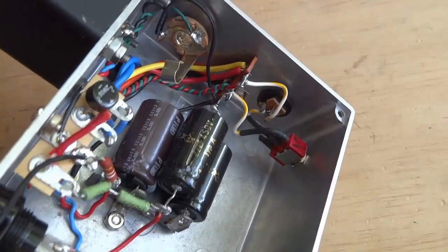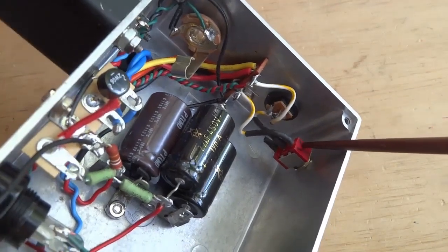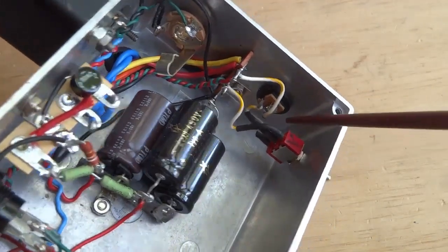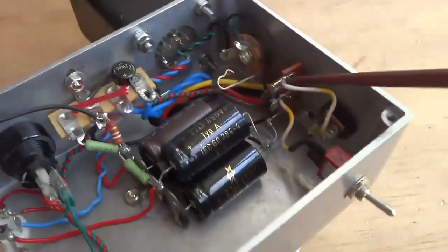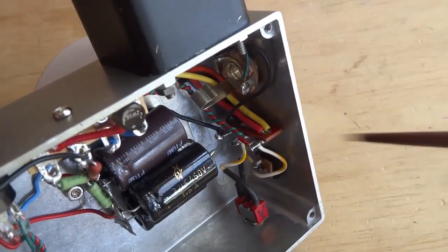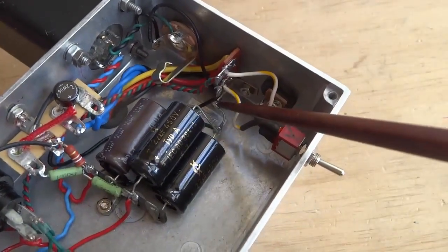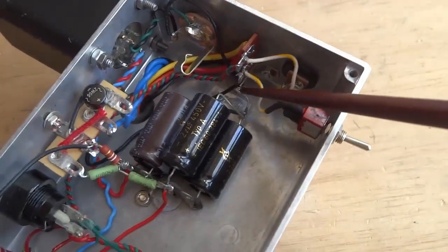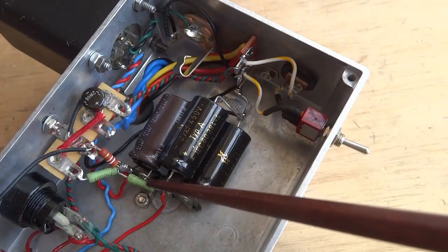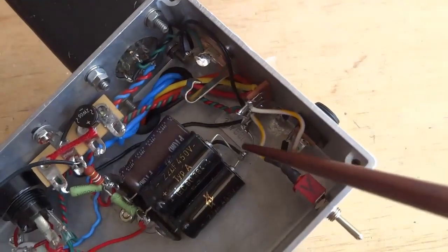It's very difficult to connect more than 1 wire to either the power jack or a toggle switch, so they are connected together in series and then to the 2 insulated lugs of a tag strip. Then any toroidal taps or heaters and LEDs can easily be supplied 12 volts from these 2 lugs on the tag strip. The grounded lug on this tag strip is connected to the ground from the other 2 tag strips, the output jack ground, and the negative leads from the filter caps.